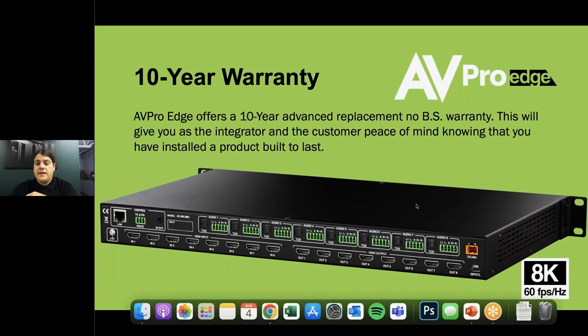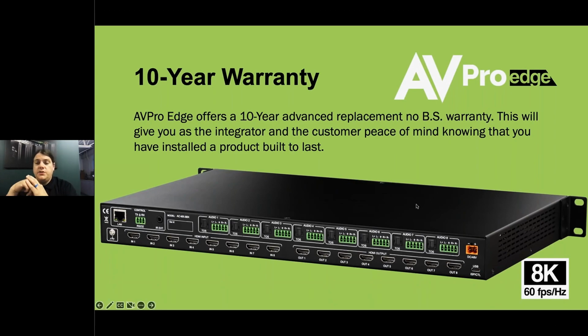I have another question from Michael. Does the Toslink output 2-channel or Dolby 5.1 or both? Both. So Michael, let's look at the picture right here. This Toslink, remember, it's not going to convert it. So Michael, you don't get to choose that. You have to choose that with your source. So if you wanted it to be 5.1, you'd want to make sure your source can handle 5.1 and has a 5.1 EDID in its configuration. Then after it came out 5.1, you wouldn't be able to de-embed it.